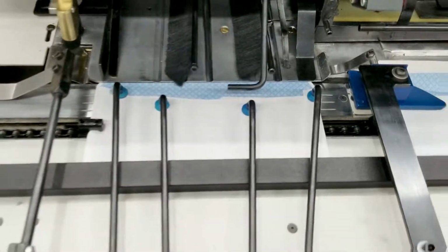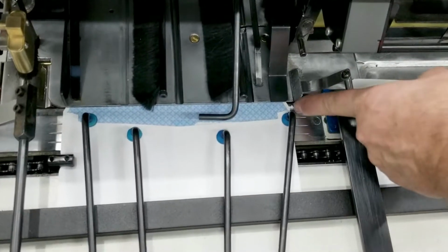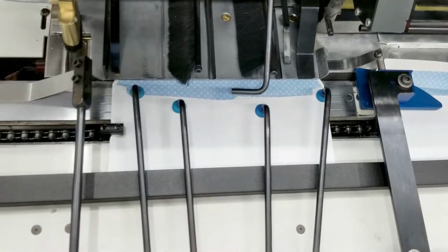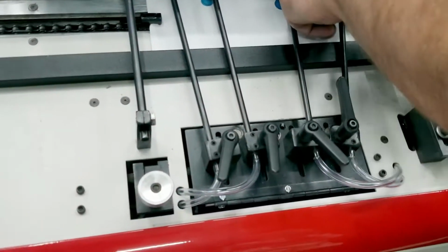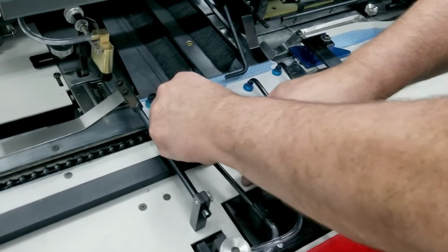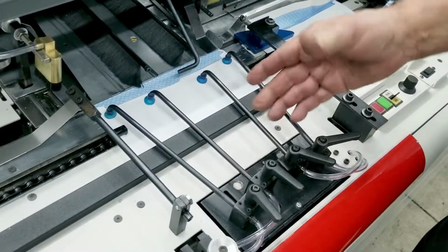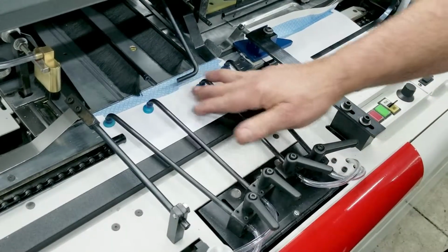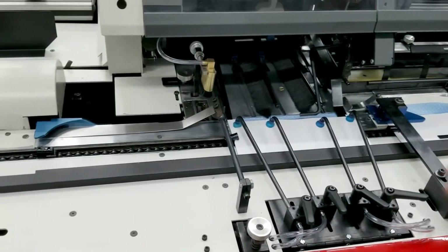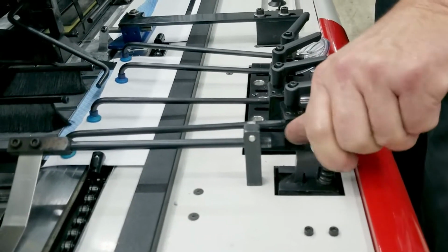And at this point, we're going to move our table so that our envelope comes in line with the edge of the plate right here. Okay, we just do that with the switch. We're going to move our suction cups to pick up the envelope the way that we want to pick it up. Move them in the corners of the envelope. We put these nice levers on here so it's easy to loosen the suction cup tubes to pick up the envelope. We're going to allow the envelope to pick up. You can adjust the opening more or less. Less opening, more opening.